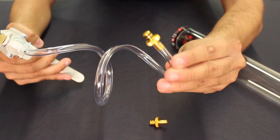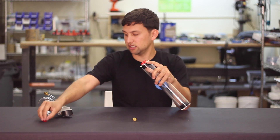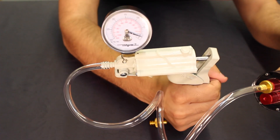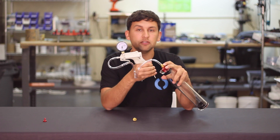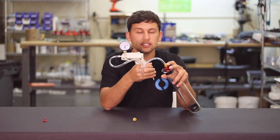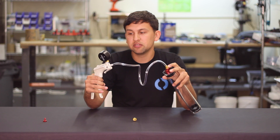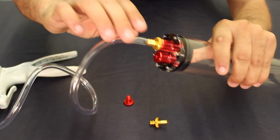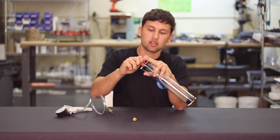I've got a 2-inch enclosure here, and I'm going to start by removing the plug that is currently keeping it sealed. I'll pop in the vacuum plug attachment, and as we pump this we're going to be bringing this enclosure to vacuum — removing air and decreasing the pressure inside — which basically simulates what it's like to be under a few meters of water pressure. By doing this we can test to make sure the seals are not leaking and that there's no hair, dirt, or dust particles in the seals, so we can be much more confident it's going to work well in the water. After a few pumps the pressure is brought up and we just monitor it for a few minutes to make sure it doesn't lose vacuum, which would indicate a leak. When done, we just pull out the plug, replace it with the original plug, and it's ready to get wet.